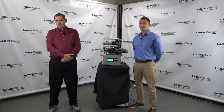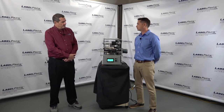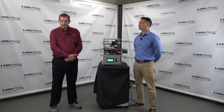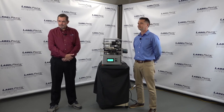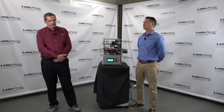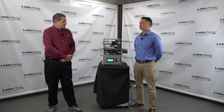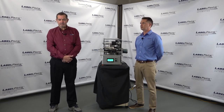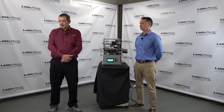What is the max label length? For a five-gallon pail we've run about a 14-inch rotation on that, and we haven't had to try anything bigger. What is the throughput? The throughput is very subjective — it depends on operator dexterity, the size of the label, and the size of the product. For a simple application like this bottle, you're looking at somewhere around 20 to 25 a minute, provided that the supplies are right next to the operator and they have a place to set them when they pull them out.